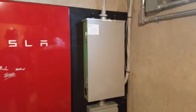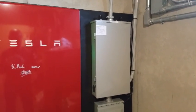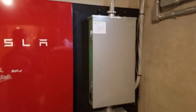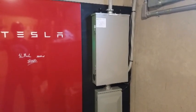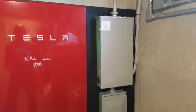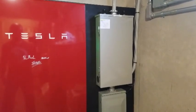To the right, you'll see the gateway. The gateway is what handles the flow of power — where power is directed when it comes into the house. You'll see these two accessories at the top of the gateway; those are actually antennas. Those antennas connect directly to Tesla's network. So if for whatever reason you lose power or network connectivity, the gateway still maintains access to Tesla's network and you can still get uploaded information regarding your installation.